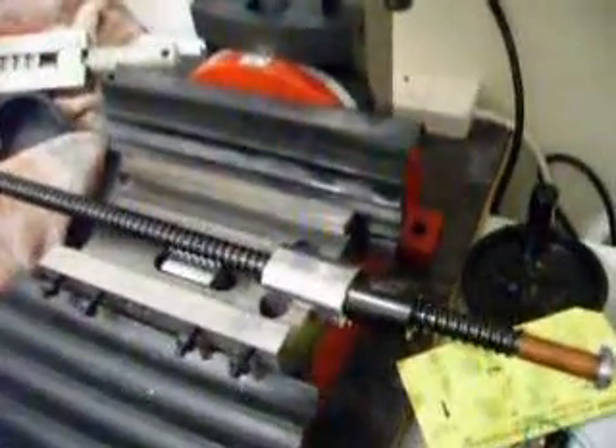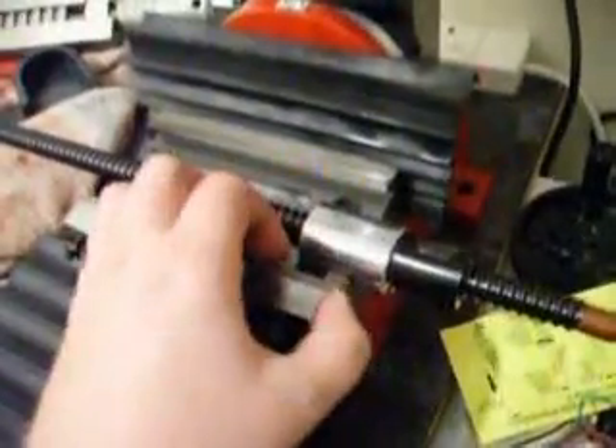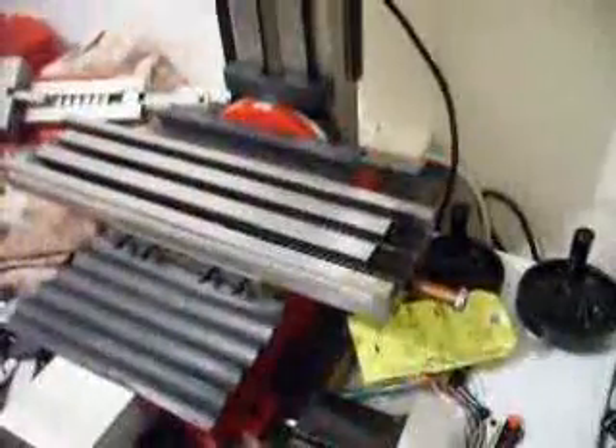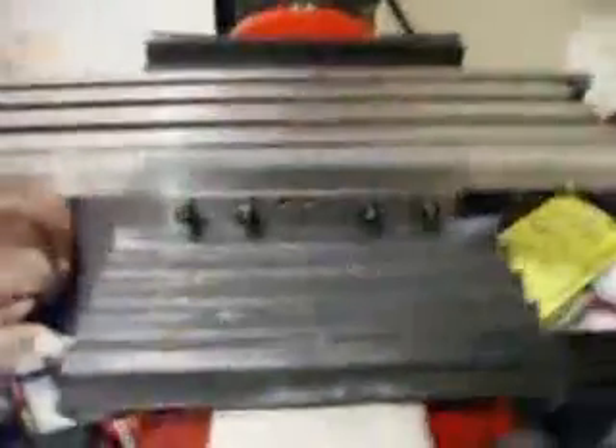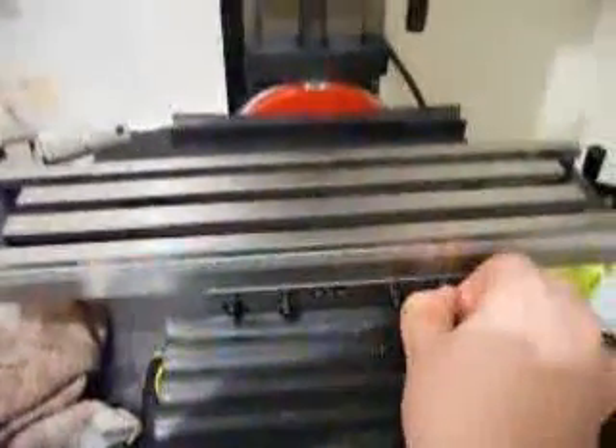I've left those loose for the moment — I think those are going to require further adjustments. Next I'm going to re-mount the gib. I've slid the gib into place; remember these are fully loosened at the moment so they're not gripping the gib. Now I'm going to refit the final table. That was quite straightforward — I just slid it in from this end, keeping an eye on the gib from underneath. After I'd slid it into place I checked the gib and lined it back up behind the block. I'll tighten the gib screws just finger tight to hold the gib in place.